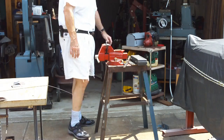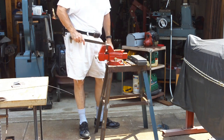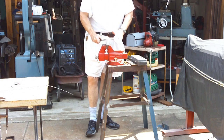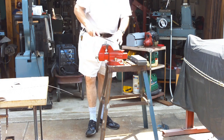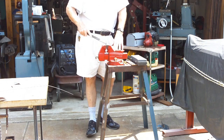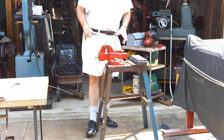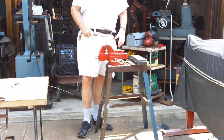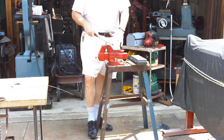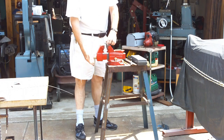What could be more appropriate than actually using the vise stand to help finish the vise stand? So I'm just knocking the burrs off the future feet, which will be welded on down there. And maybe you notice my foot — I kind of locked it against the leg here. That kind of tells me where I'm going to have to put the foot brace that I plan to install on it, so that when you file, you have a place to rest your foot. It holds the thing steady. Quite practical.